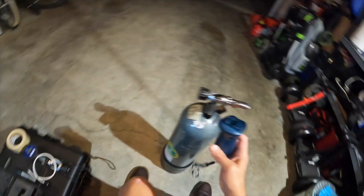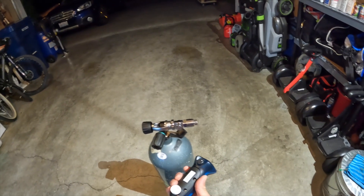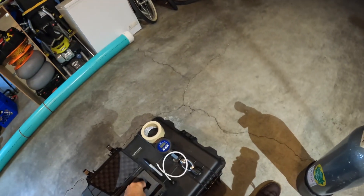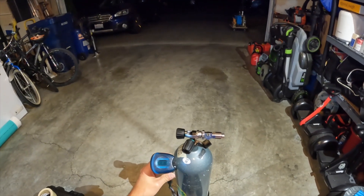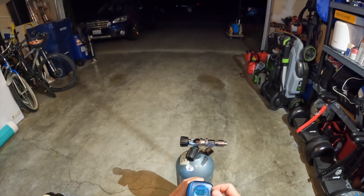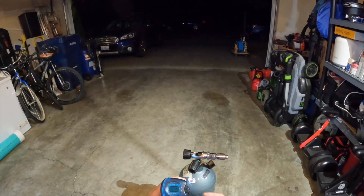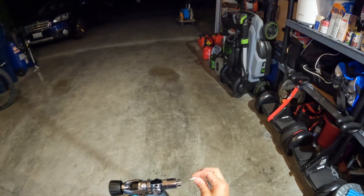Let's go ahead and switch our attention over to the Analox O2 sensor. We have this dust cap — as I mentioned, it's just prolonging the life of the O2 sensor so it's not constantly getting access to ambient air and oxygen. We'll open up that dust cap and turn it on with this button. You just sit there and let the ambient air get into it. We want to go to 20.9 — just turn it until we get to 20.9 and make sure it settles out there. It is currently at 20.9, and that is calibrated to our ambient air.